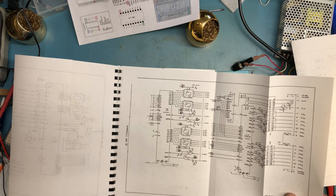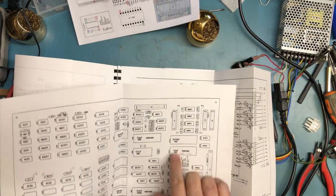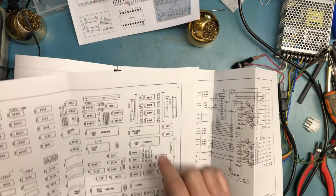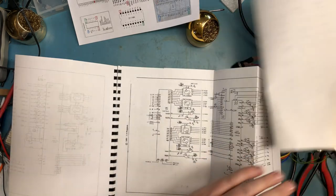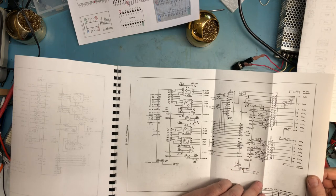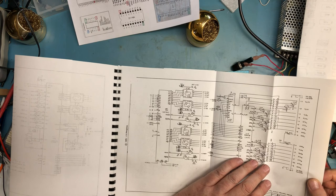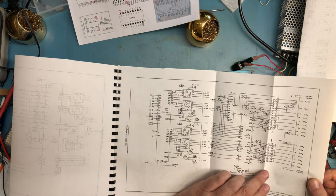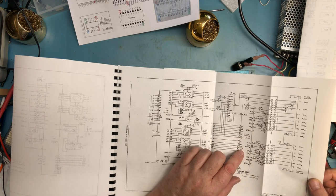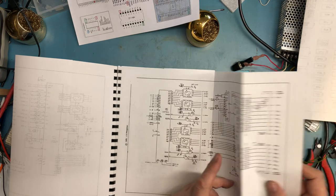3884/0 is the UART. It should be labeled. It's a 3884. Actually, I added that label later on. I know it's marked with the MK number. The line drivers and receivers look like it generates two. Oh, it's a dual, so there's two full serial ports on it. Nice.